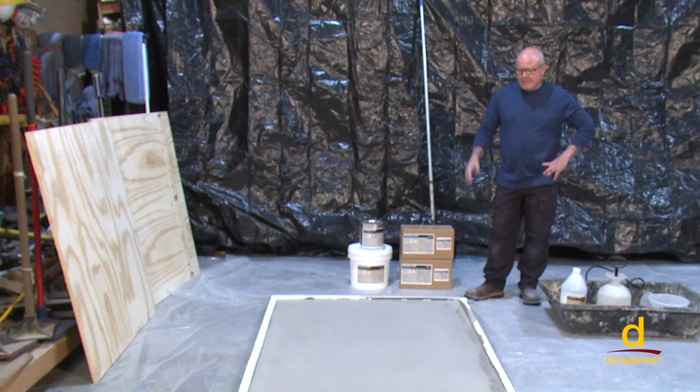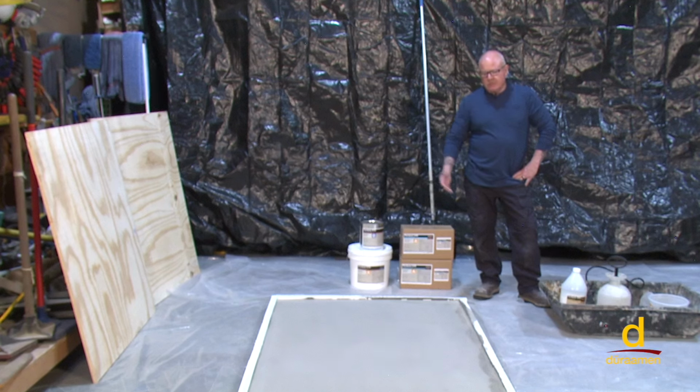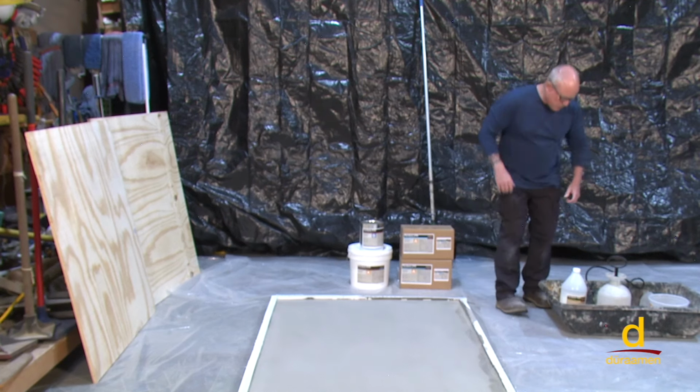Our Aquacolor has had sufficient dry time, so now it's time to apply our first application of sealer, and we're putting the water-based A03 down. Coverage rates vary a little bit depending on what it is you're sealing. In this case, we're sealing the Perdure 5500, so you're probably going to be somewhere in the range of 250 square feet to 300 square feet per coat per gallon. On concrete, you might get a little bit more coverage than that.